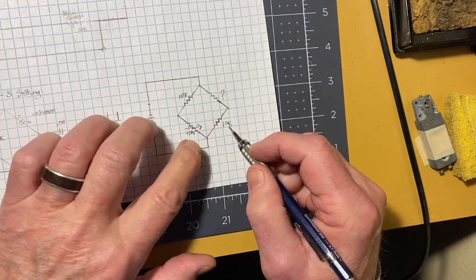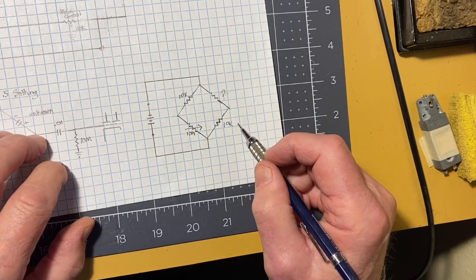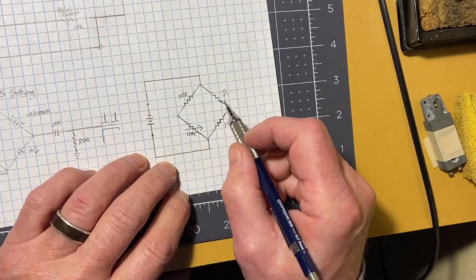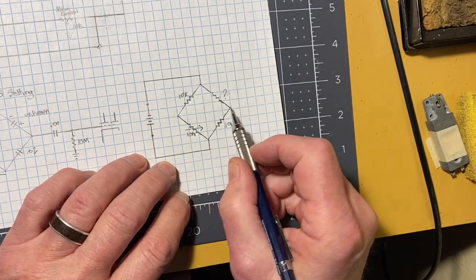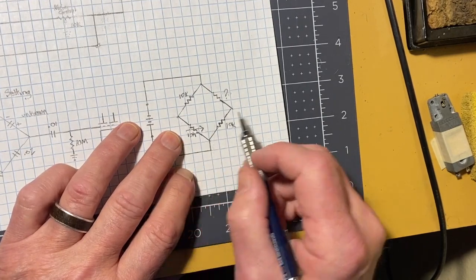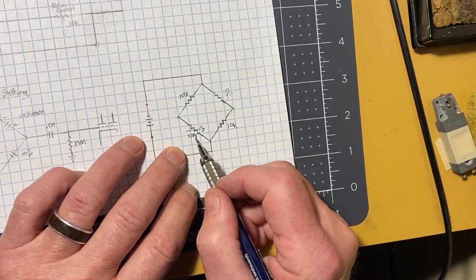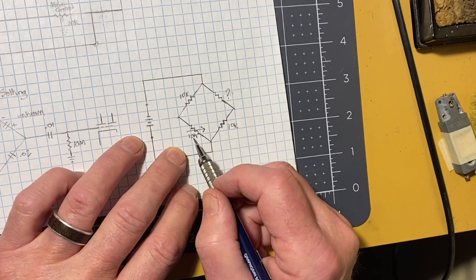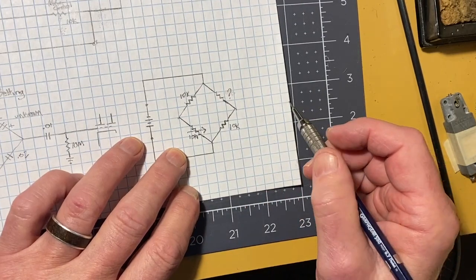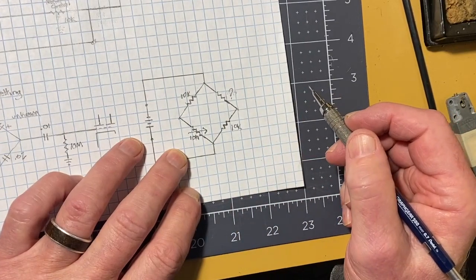and this leg. So we can increase this one or decrease it, increase this one or decrease it. And at some point, if this is within some range of resistance, we're going to hit a point where we have nulled this out. This voltage across here will reach 0 or nearly 0. And when that happens, we know mathematically, and we're not going to get into the math of this, but mathematically, the value we've found for this variable resistor plus these two 10Ks that exist in the circuit will let us calculate what the value of this unknown resistor is.